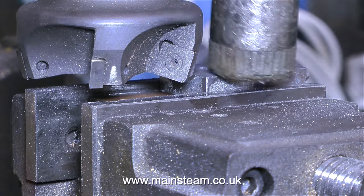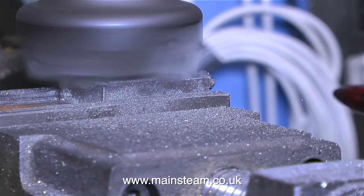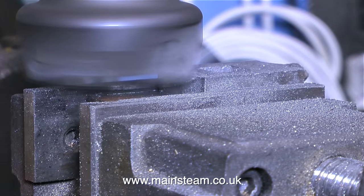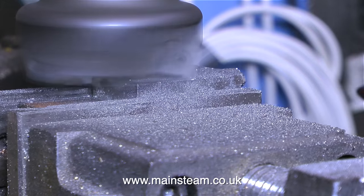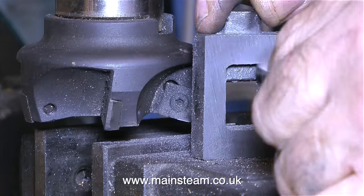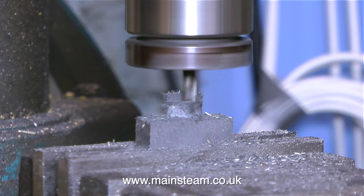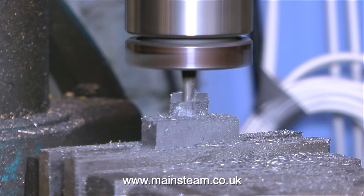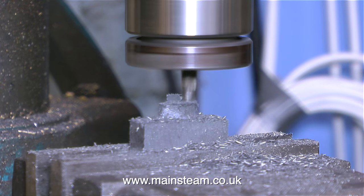In this clip, I'm using a soft mallet to make sure that the casting is firmly positioned where I want it to be. And off I go with a very light cut with the face cutter once again. Even though I've used a blunt carbide-tipped cutter on a very old Taiwanese milling machine, the piece is accurate — my micrometer confirms that it's the same thickness throughout. This steam chest casting is from a Clarkson Steeple engine, and when I bought it from Black Gates, they were telling me that this is an engine they're going to be supplying castings for.